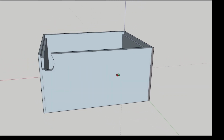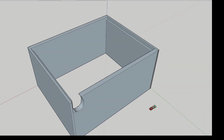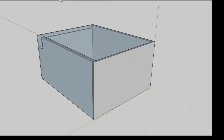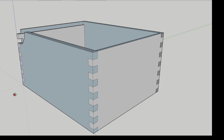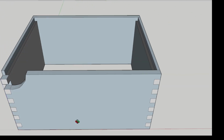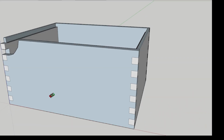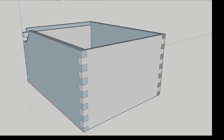So this is the standard brood box with simple rabbet joints on the corners. This is the one we will be making in this video. You can see here the measurements, and there's also a link to a PDF document in the description. This is the alternative brood box with finger joints. This is not one we're going to be making in this video, but I've included it here just for information.